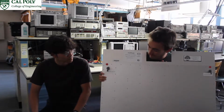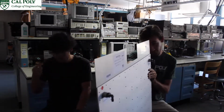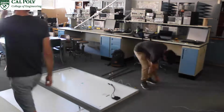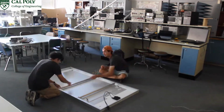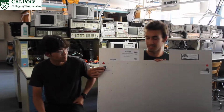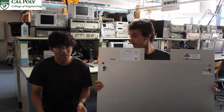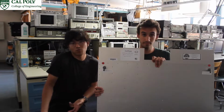This is the Sundrum hybrid solar collector. Basically, this is a very thin reservoir that water can be pumped through so that you can harvest both thermal energy as well as electrical energy. Water's pumped into this gasket and then through the whole reservoir and comes out of this gasket heated, which in turn cools the panel. And all of this is plugged into some big water reservoir for home installations, maybe like a pool. That way you get a warm pool.